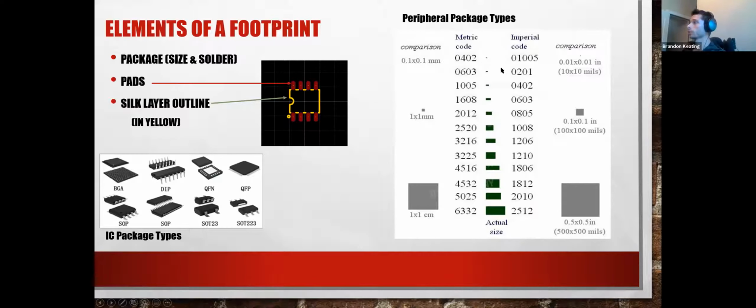But yeah, so your component size is really going to be dictated by a couple of parameters, which is just the overall size of your PCB, any constraints that have to do with just the dimensions of that. And then again, power in some cases, but in general, 0603 can handle anything up to about 10 volts. After that, you might want to go to something a little bit higher if you're dealing with anything over 12. But a 9-volt battery is totally fine to hook up to a 0603. Any questions about this?